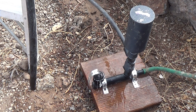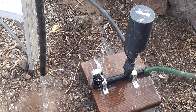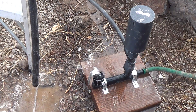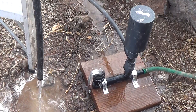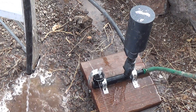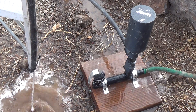There's water coming out of our output pipe! You can see the output valve opening and shutting — it's actually giving us a pretty good stream of water, look at that. That's a successful test of a 3D printed water ram. This will sure save a lot of money on building water ram pumps. Typically those one-way valves are $50 a piece or more depending on size, so this will probably cost all together about $7 to build, and just a few hours of time. Hope you guys enjoyed — until next time.